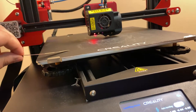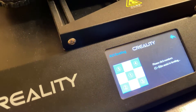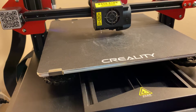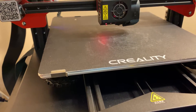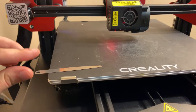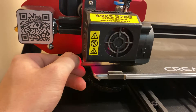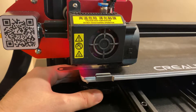We hit aux leveling — which I'm pretty sure means auxiliary leveling. It's going to tap twice in the middle, then lower one more time without tapping. Just wait for it — don't click the screen yet. So now I go to zone 2: it lowers and goes right there. You can see there's a whole bunch of room — this needs to be lowered. So I'm going to raise the bed.